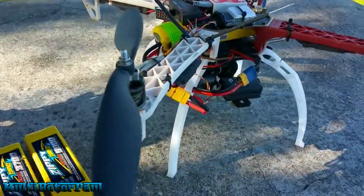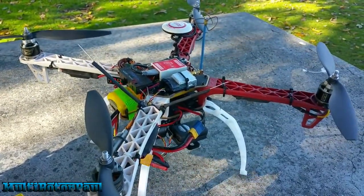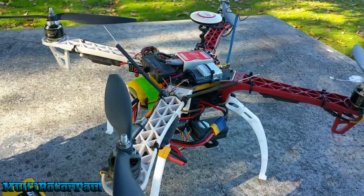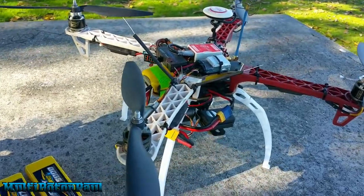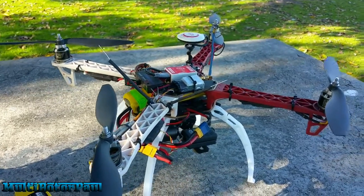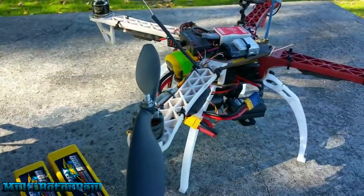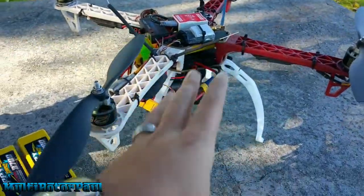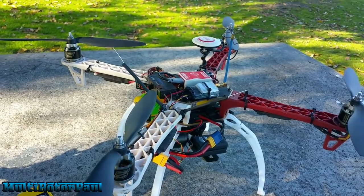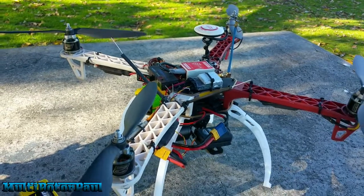If you don't have one of these watt meters, it's pretty cheap — I'll put a link in the description if you want to check it out. But there's another way to see how much power your quad or multi-rotor is using, and it's typically referred to as the gram-to-watt ratio. I did the calculations on my own quad several months ago. After flying for a minute, I charged the battery back up to see how many milliamp hours it used during that 60-second flight, factored in how much the quad weighed at the time, and found out my gram-to-watt ratio was something like 4 grams per watt.